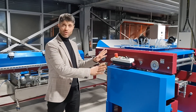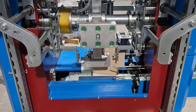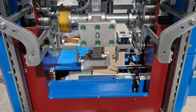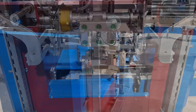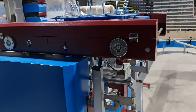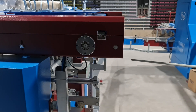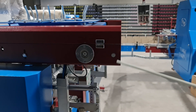And here is the bag-making machine. The system of placing the bag directly down onto the conveyor in a centered manner is very helpful in small boxes. Thus, these bags fall directly onto the conveyor without tipping over — this is the biggest advantage of this new system. The box-making system has sensors that stop the system if there are enough boxes on the conveyor. While the main engine and vacuum operators are turned off, only the glue heaters in the containers continue to operate, achieving significant energy savings.